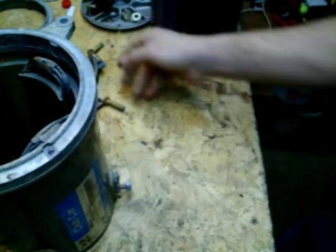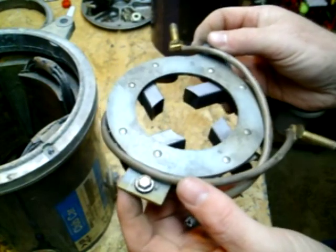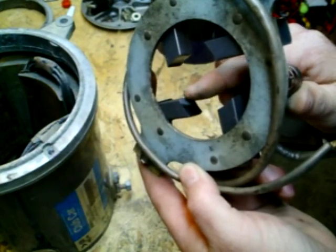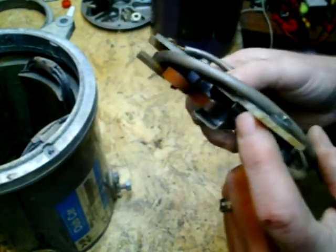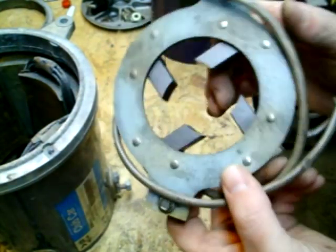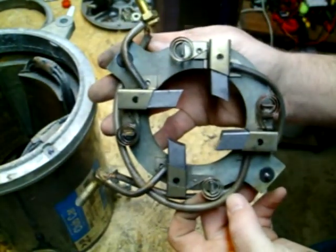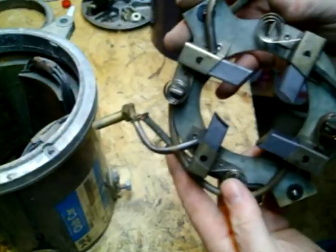Another thing I want to touch on is the brushes. It's really kind of hard to see, but you can see this brush here — that section that's lighter wasn't making contact. If you put in a new set of brushes, it really does take a little bit of time. I ran this motor for a good six months and did quite a bit with it, but you can see how the brushes aren't quite worn in yet, so the transfer into the armature — a couple of them are worn pretty good. This is what the whole assembly looks like inside if you've never had a motor apart before.